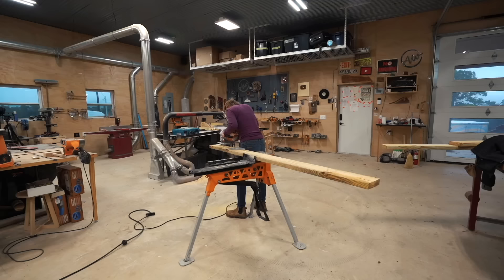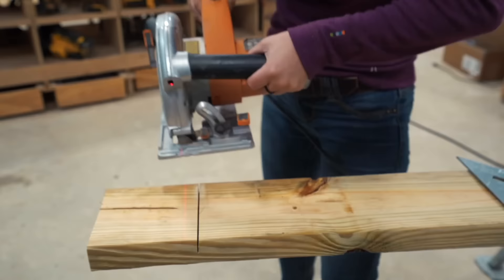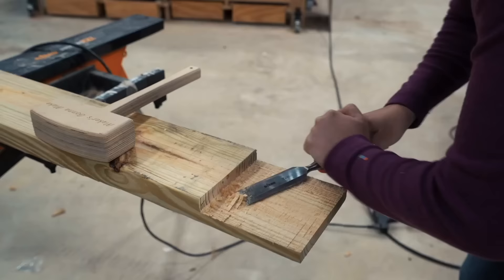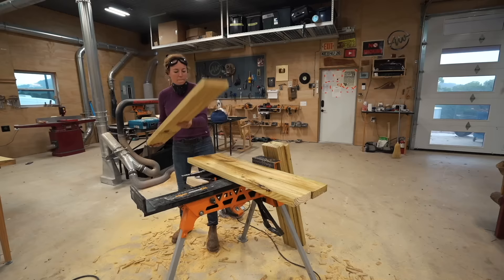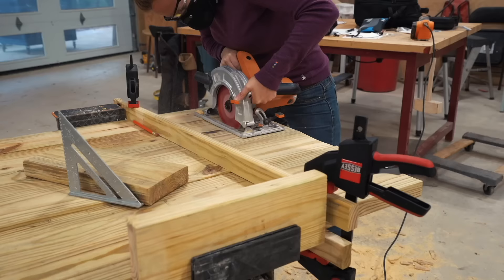One of the last things to build was the gate entrance with the two doors. I went to my wood shop and built the doors with simple but strong half-laps at all of the connections. I started by placing each stile of the door in my Super Jaws, then using my circular saw to make multiple cuts so that I could come back with the chisel and knock out all of the pieces until it was flat. When it came time to cut all of the half-laps in the cross braces, I decided to gang-cut them. The Super Jaws have a feature where you can flip the jaws around to drastically expand your holding capacity — I did that to hold every rail needed, clamped two boards on the top and bottom to hold the faces flat, and then repeated with making multiple cuts with my circular saw. I'm pleased to say that this worked and saved me a ton of time by doing it all together rather than individually.